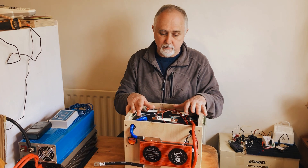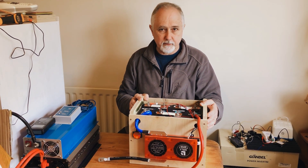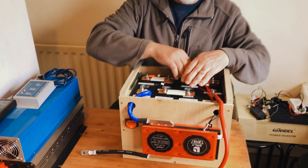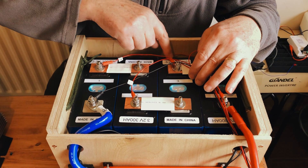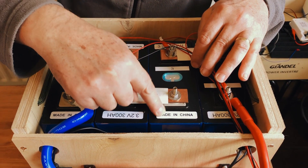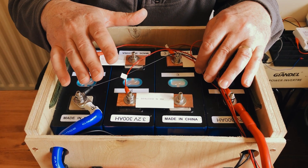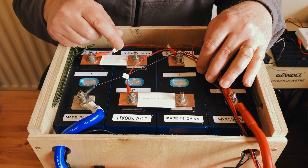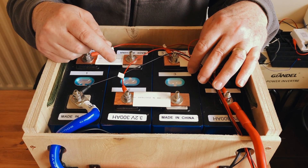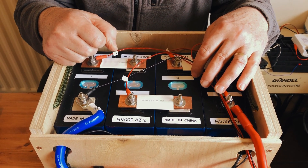They cost about $600, so it's not a bad deal financially, but it is not the stated capacity — and if you're selling something as 300 amp hours, it should meet 300, not be approximately five percent short. In our experience, good quality cells have a QR code that serves as a serial number with additional embedded information. These cells have none of that — just the nominal voltage of 3.2V, 300 amp hours, and 'Made in China.' There is no QR code and no individual cell identifier, which raised quite a number of alarms in the early stages of testing.